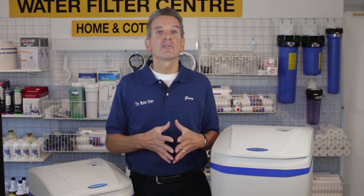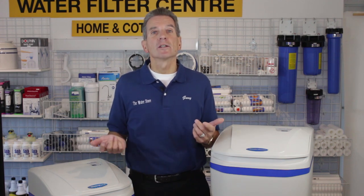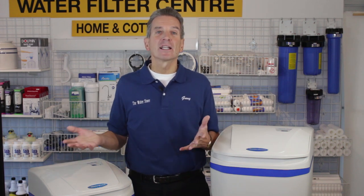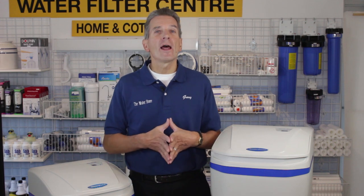Compared to a conventional water softener, it could be 50, 60, or even 70 gallons of water per regeneration. And regeneration time is very short — 20 to 25 minutes, in and around that time range — again compared to a standard-efficiency water softener where you're talking an hour and a half to two hours.